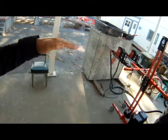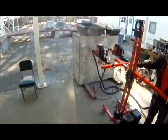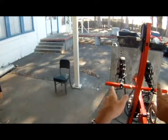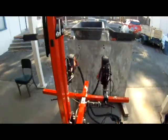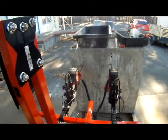Do you think, what's causing that when you're coming out, it backs down a little bit, so when it pushes in, it kind of goes up and then pushes? Yeah. Because when you release, and right when it comes out of the hole, yeah, I agree. It goes down about. Yeah, I agree. That's the bit walking up about an eighth of an inch as it's going in. Yeah. So as we touch it, there's a little climb there.